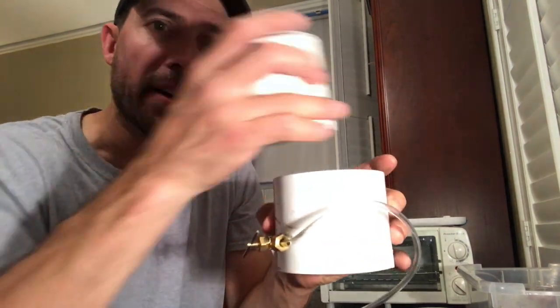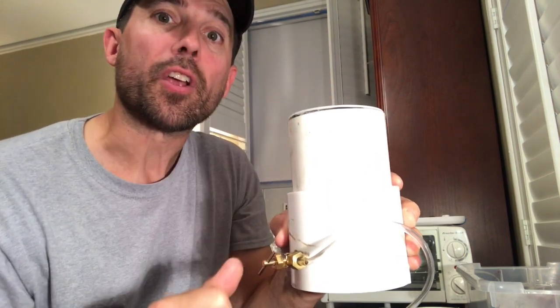Okay, one warning, very serious. When you first fill up your containers with the powder paint, do not leave the lid off when you put the container inside the fluid bed base. If you do this without the lid on, you're going to be the color of whatever that powder paint is. Trust me. Along with that, just make sure that any surface that you're doing this on, you either have covered with something like a drop cloth or something else that will protect the surface. You don't want this to get on your clothes, per my warning there, and also absolutely not on your carpet. If you get it on your carpet, it's not coming out. I don't care what you do. Trust me, once more, I know.